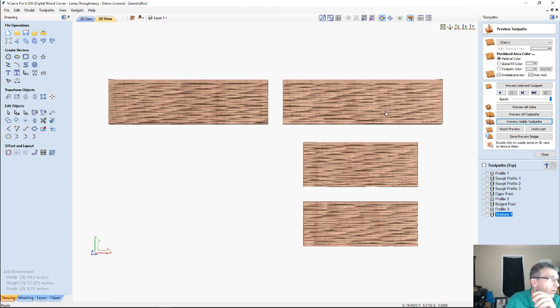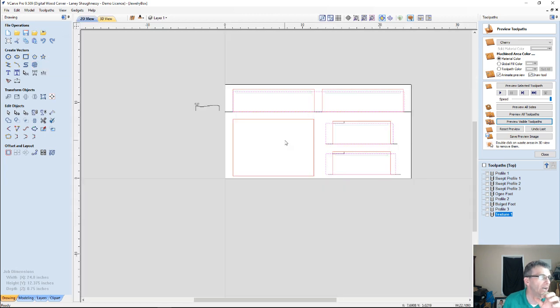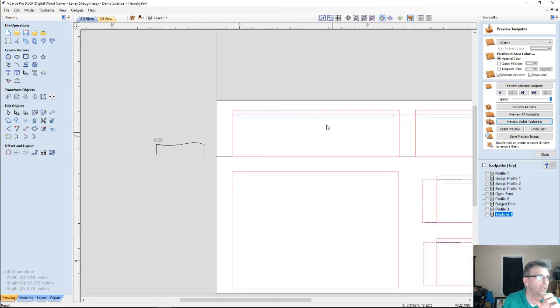Now alternatively, we could use the texturing tool over here, the draw vectors, but this creates a series of waved lines and things, and so I prefer the texturing toolpath, which is more random. But if you want something a little bit more consistent, a little bit more flow consistent, then using the vector texture patterns would be better.